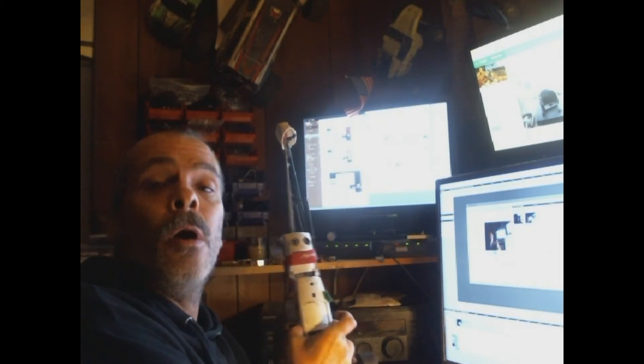The simplicity is that if you know how to program C++ and you need to get something done in Visuino — like reading the gyroscopes, doing all the math, and reading all of the remote control channels — this is really important for your interrupts. You no longer have to use the blue pinned ones in Visuino. You can create your own interrupts on your pins. The next section will show reading six RC channels instead of two, using the onStart section to define, include, and create your interrupts.